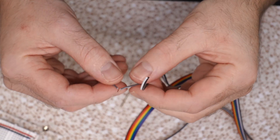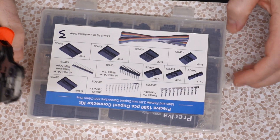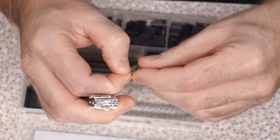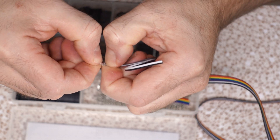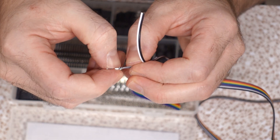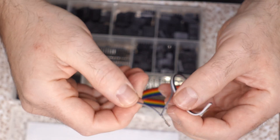So we only need to tap one signal from the power button. I've taken this ribbon cable, I've mid-stripped it, twisted it up, and then I have this Preciva kit with DuPont connectors. I'm going to need one of these female connectors. Even though this is a lot of shielding, I'm going to try to mash this shielding a bit thinner and see if I can get that on there. Then we crimp it. Now we have that going on.